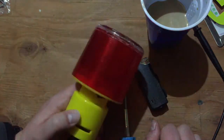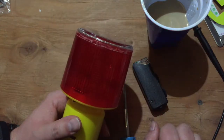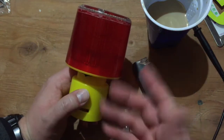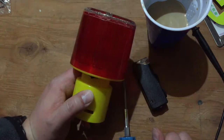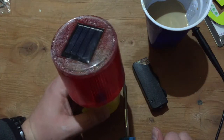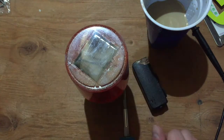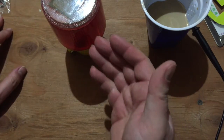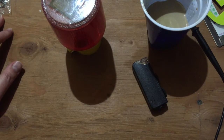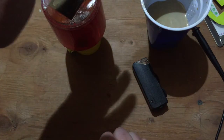I thought I'd take a brief moment and describe how these operate, in case you're not familiar with the typical solar garden light, because that is fundamentally what this is — just a re-spin of it, with blinking red LEDs instead of a continuously on white LED. The key to it is that the solar cell is used for two purposes: charging when there's adequate light, and then when the light level falls, it turns on and blinks. That's all there is to it — just basically the identical design except for the packaging.